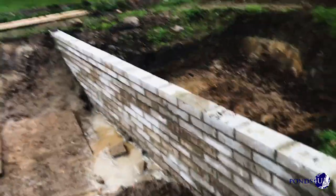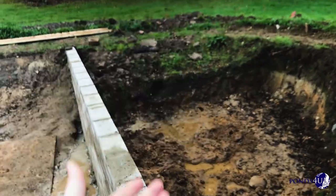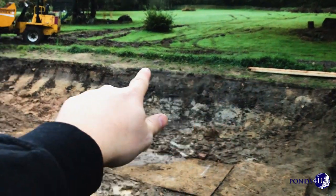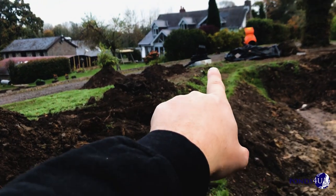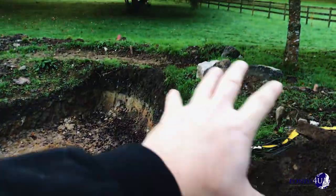This wall here is segregating or separating the filter, which is going to be a bog filter with loads of different-sized rocks. The water will actually work its way up through and then come back into the pond. It's going to be planted all along the edge. There's your height — that little bank, there's your height. This wall was all set yesterday but we've got to dig it back up and there will be the water height. You'll have a ledge all the way round, wooden sleepers across the top of the wall, and nice gravel. This section will be all rocked out.